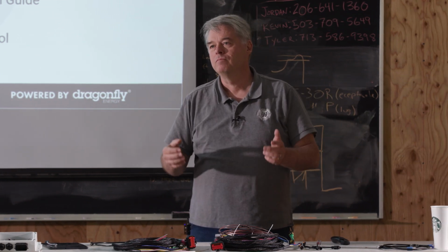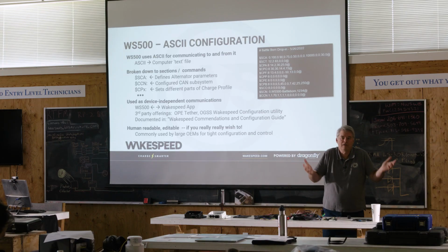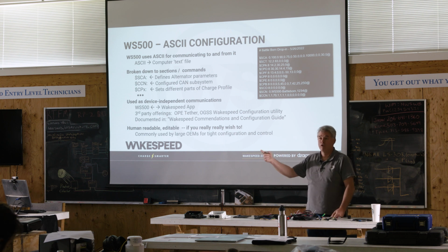That's it. There's no 48-volt. There's no 2,000 amp hour batteries. They don't exist. A 12-volt, 500 amp hour battery. Now, we get to those other voltages in runtime because we apply multipliers.